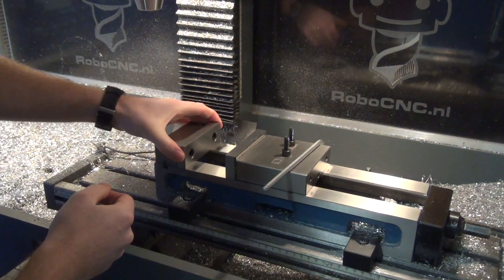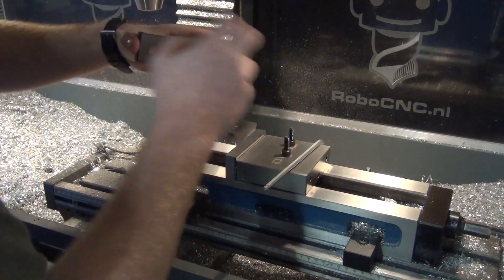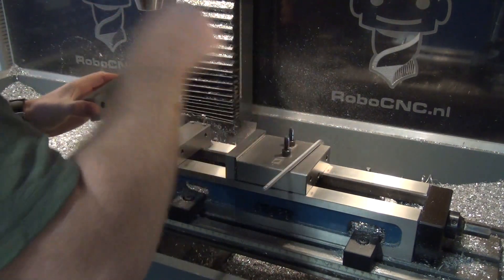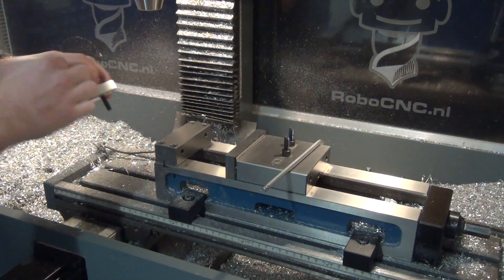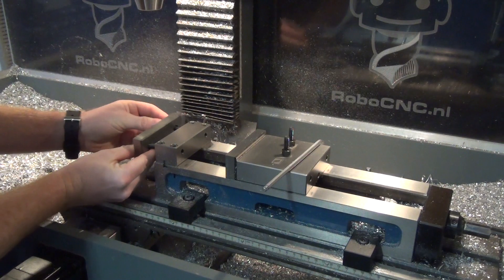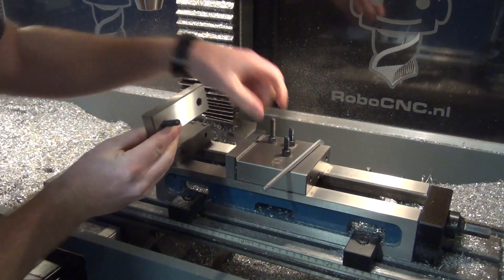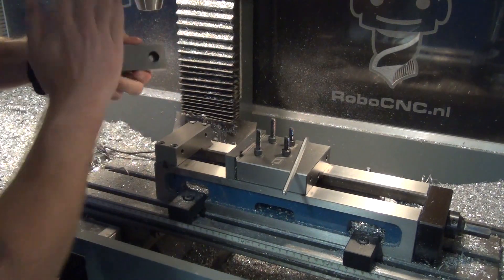The L-series is the long version of the 4 inch vise. Basically this is 4 inch wide, or 108 millimeters wide. And if you open the vise to its maximum position you can open it to 210 millimeters. But I needed 230 millimeters, so I had to change the vise jaws to the other side.